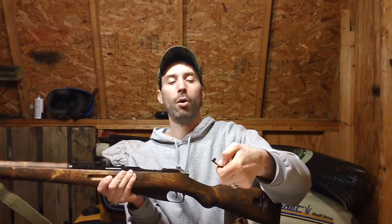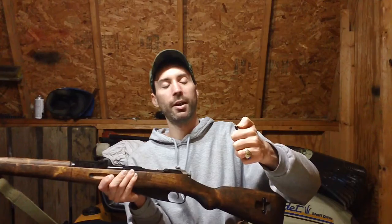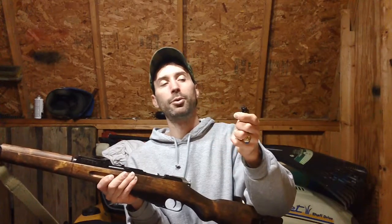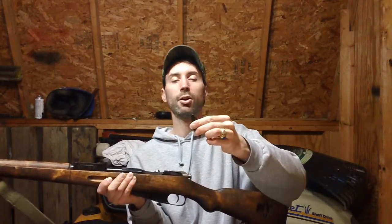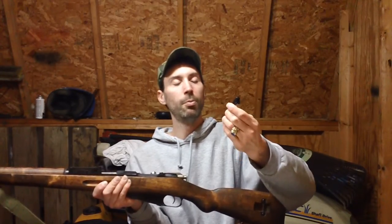The sear is polished in the middle and on top, and they put a slight bevel in the back so when it contacts the rear cocking piece, there's hardly any movement there — it's a nice clean break with very little travel. They also modified the actual trigger part you put your finger on by putting two roll pins inside, where it pushes onto the sear spring, to take up slack. Most Mosins have a trigger that wobbles back and forth, but they solved that with those two roll pins combined with the new sear spring and polished components — that's why they call it an improved trigger system.